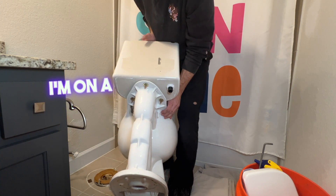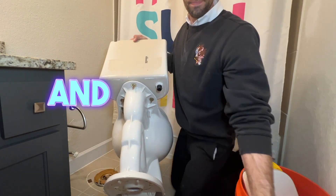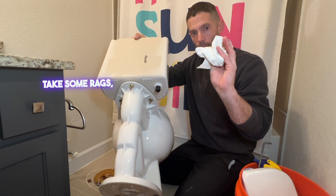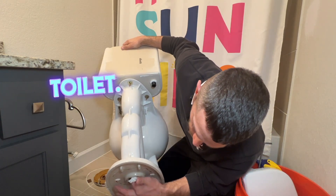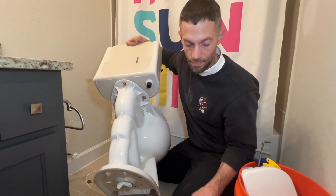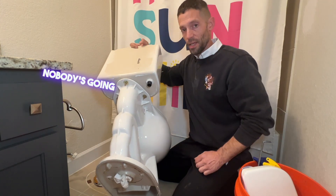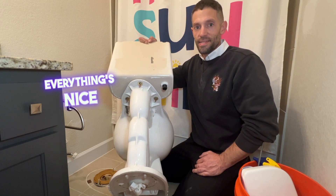Because I'm on a second level, I'm going to take some rags, ball them up, and stick them in the outlet of the toilet. That way I know that no toilet water is going to be dripping on anybody's carpet as I bring it outside. Nobody's going to have to clean up after me and everything stays nice and clean.